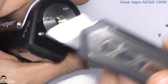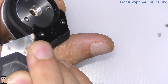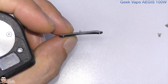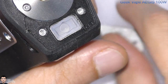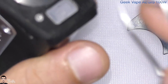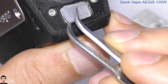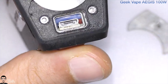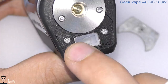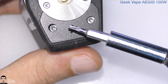You'll need something like an exacto knife to remove the plate from one of the edges. Removing this part, you can see there are the same holes and a metallic burr — in case a battery vents inside, the silicone plug gets pushed against that bar, eventually opening a hole and letting the battery vent. To do a firmware upgrade you remove that silicone plug — they give you a spare — revealing the micro USB firmware upgrade port. After upgrading, replace the silicone plug, the top plate, and screw it back using a T5 screwdriver.